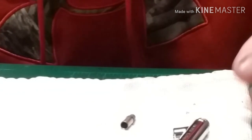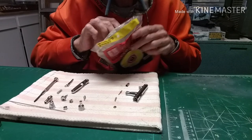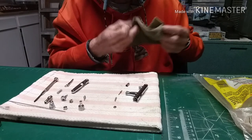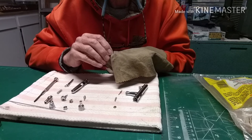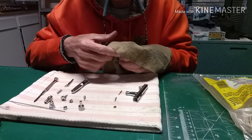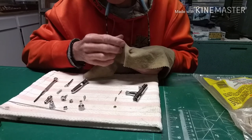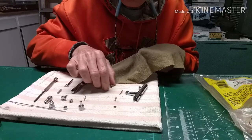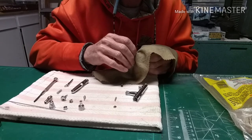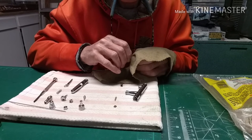I'm going to show you another small trick I've learned. I use a silicone-impregnated cloth and I burnish this on all my outside surfaces. This is a molecular bonding type of oil — it is not a lubricant type oil; it bonds with the metals. I put it on threaded portions and on the shaft of the air valve, and on the outside sleeve of the air valve, taking care not to smear a bunch on the seal.